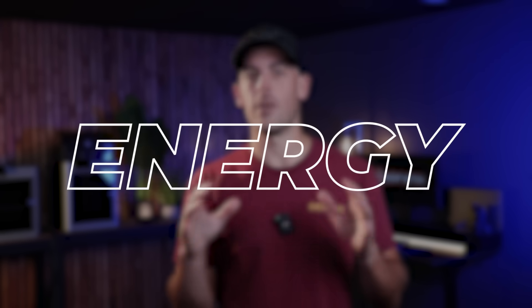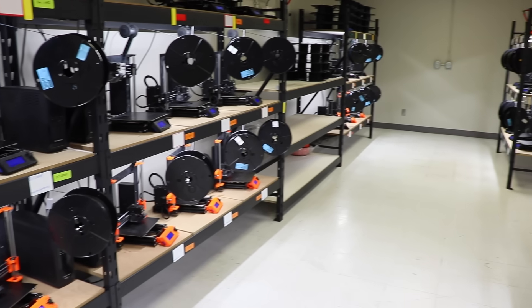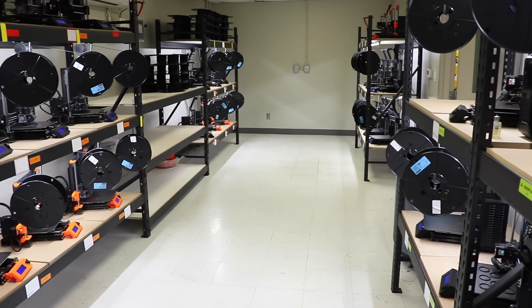Number two is energy. Each printer individually does not gobble up a ton of power or create a lot of heat. But putting a lot of them — say 40 — in a small room is a different story. All it takes is a print farm growing to around four or five printers before you need to start thinking about power. At that point, you need to expand beyond one circuit, which, if you're doing this in a bedroom, may not even be available.